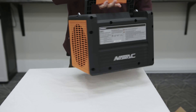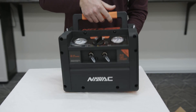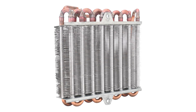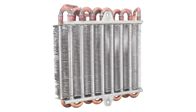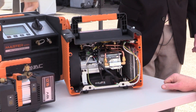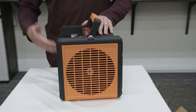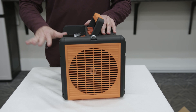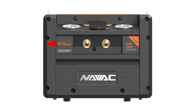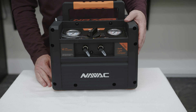It's a really simple design — I actually saw this first at AHR and then again at our symposium. It has a really high-quality condenser coil with multiple rows to make sure it cools the refrigerant actively. It has a really large fan and a lot of room for airflow through the body, which is huge for a recovery machine because you need to cool that refrigerant before putting it into the tank to reduce pressures and move a lot of refrigerant. And as mentioned, this is an A2L compatible unit, prepared for the new refrigerants that are coming out.